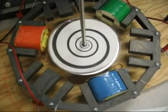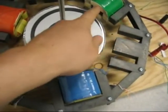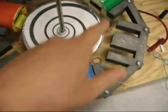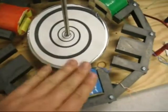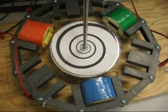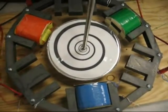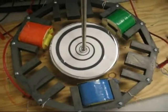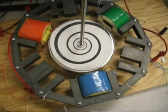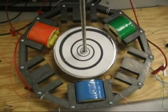You can see it didn't get going very fast, probably because the flux has to actually travel from this coil through the rotor over to this coil, so that's not a straight path — most of it wants to go straight across. So you have a limited amount coming into this one. It's obviously not spinning the rotor as fast as before, so either the design needs to be changed or it's just a bad idea to begin with. That concludes the video — thanks for watching.